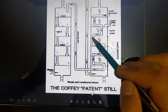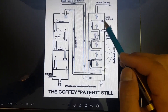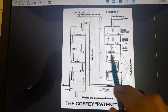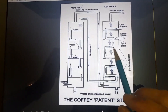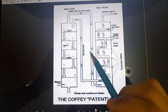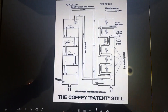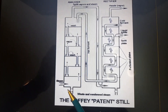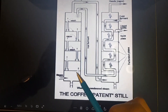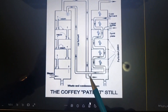The cold fermented liquid enters through this pipe, so the upper part of the rectifier is cold and the lower part is hot. The cold wash is then pumped to the analyzer column, where it flows down through the perforated plates. While coming down it reaches the boiling point, which creates alcohol vapor. This vapor passes through a tube that leads to the rectifier — once it reaches the boiling point, the vapor starts going upward through the holes and passes through this pipe to the rectifier.